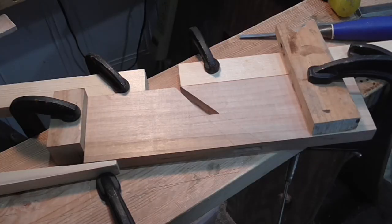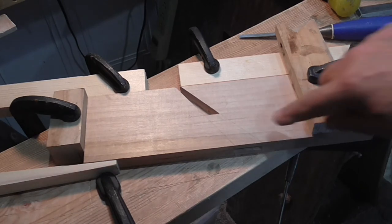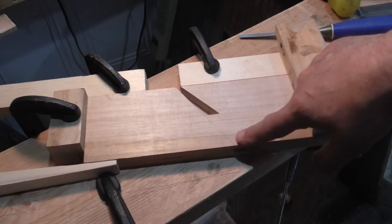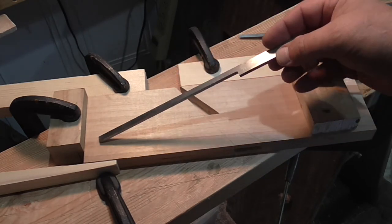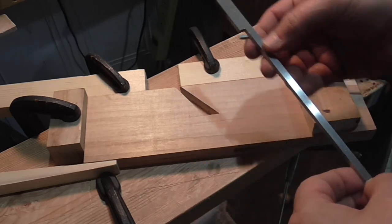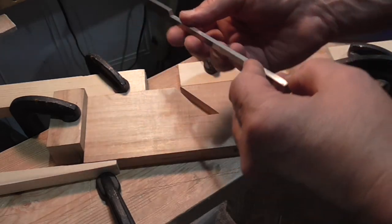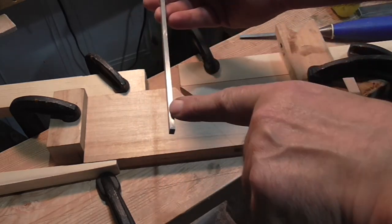I'm working on the pocket for the blade and the wedge right now. When I get to the point where I join the escapement to the wedge pocket, what I like to do is have the blade all ready to go. So I cut this, polished the part that was cut out of the raw stock, so this one is ready to go. I used a micrometer to get these two edges parallel. Came out very nice. What I noticed on the first one, and this one a little bit, is that as I clamped it to do my work, it got a little bend in it.